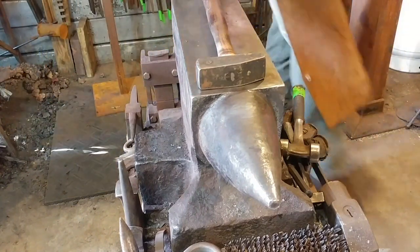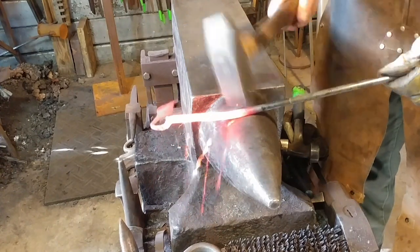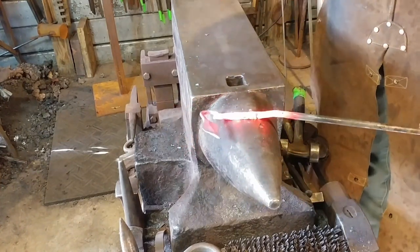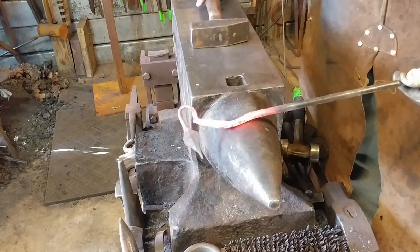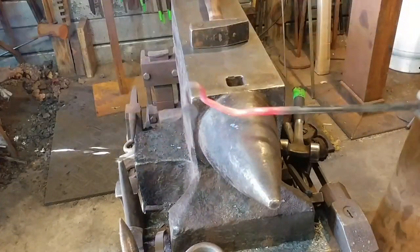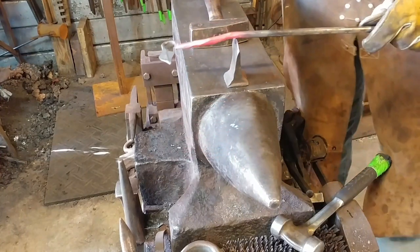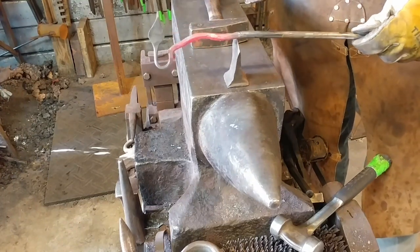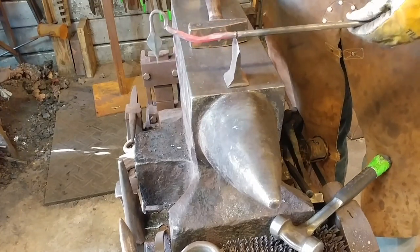This is the last heat on this. This part is where you get to just do kind of whatever little shaping you like — give it a little more dimension if you want, take the handle a little longer, make it crooked, make it look kind of viney is my suggestion. Give it some shaping, then give it a good brush once it gets below a scaling heat. Then come up to your cut-off tool — remember, cut to center, it just looks better. So I'm cutting off; this is pretty cold, but the video's gone long enough.